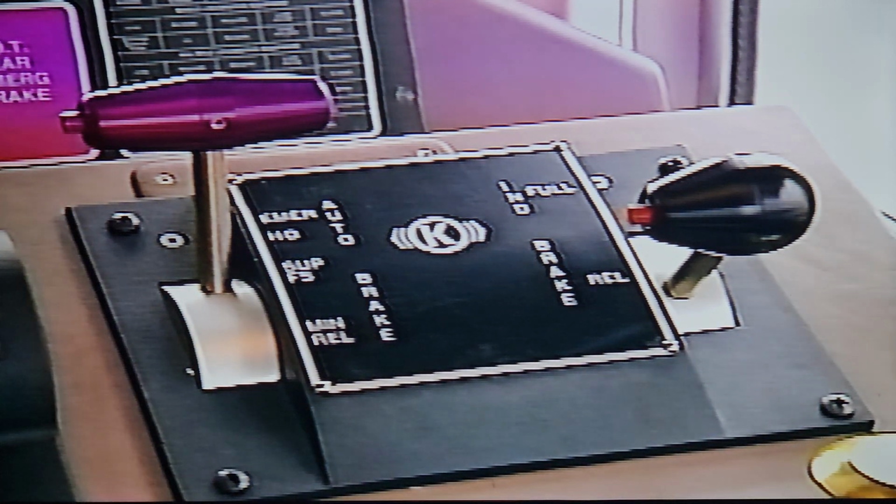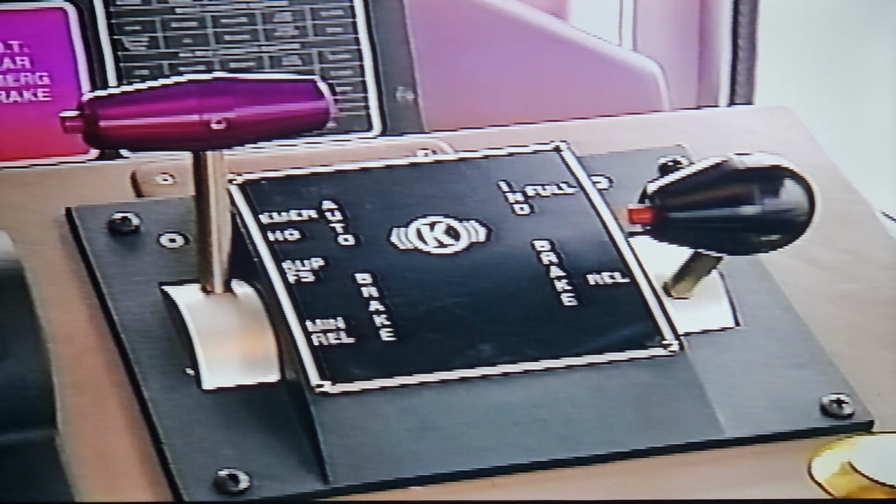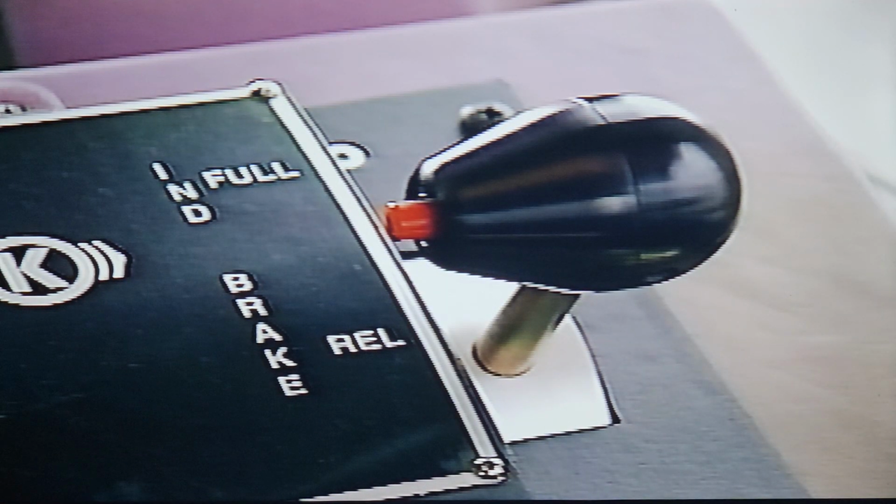CSX brake controllers will be the same as on other AC locomotives. The automatic and independent brake controllers have actuating buttons on the sides of the handles where the brakes can be actuated or bailed off. The independent brake handle is black.